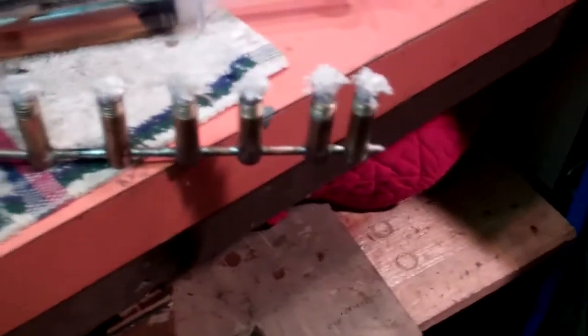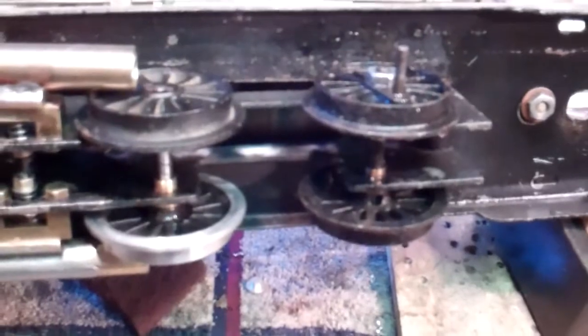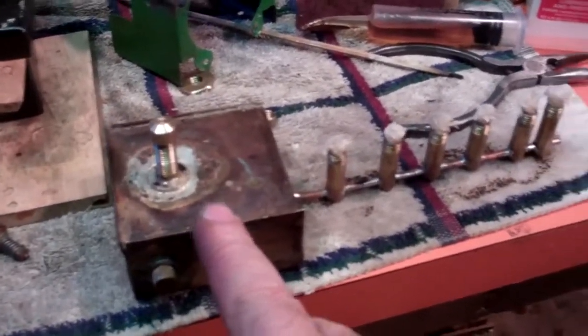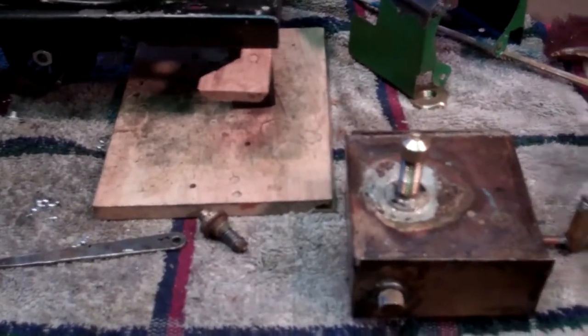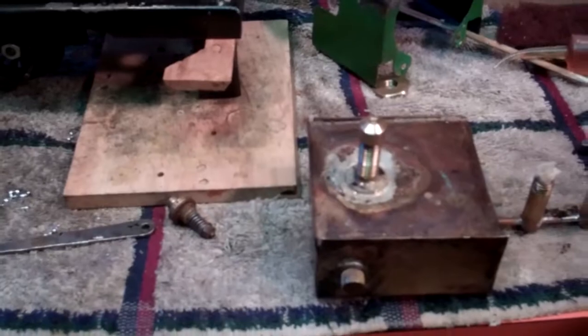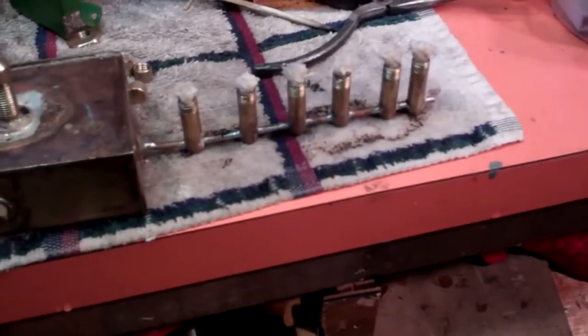So what I'm going to do now is fill the burner up with alcohol — I've got brand new wicks in it. I'm going to fill the boiler up with water and steam it up. I've got my reservoir tank filled up and I've got all new wicks in here. I let this soak a little bit so it had time to absorb the alcohol. I've also wet down this tile down here — I saturated it with water because there's always a chance you're going to have some kind of fire.